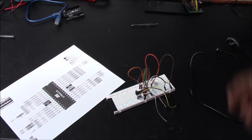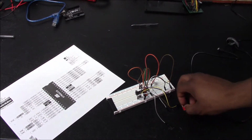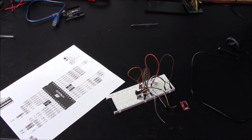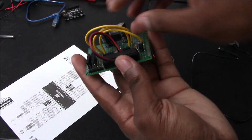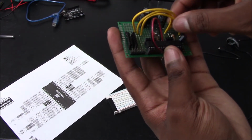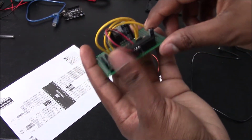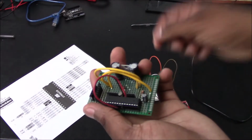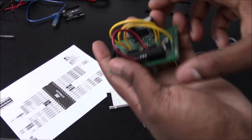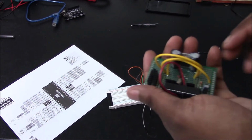This is old. It's not trash because I like to keep memories of that time when I was just getting into programming, but it is a version I have made. So what I really like is that this is a lot slimmer. If you take away the power section, it's pretty slim. I took all these wires out. In my next iteration of this, I would take all the wires out and just connect everything as you see here with the FTDI cables. You would just get it, and then you just put the wires in where they need to be, which is pretty simple, especially if you're using your ATMEGA pinout diagram here.